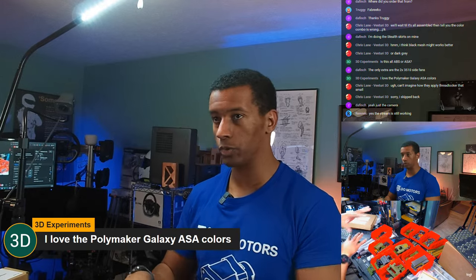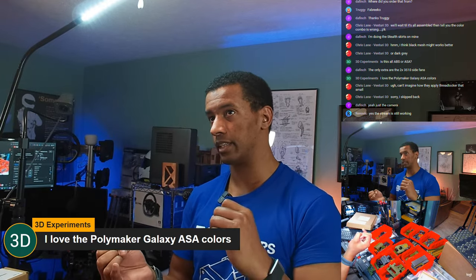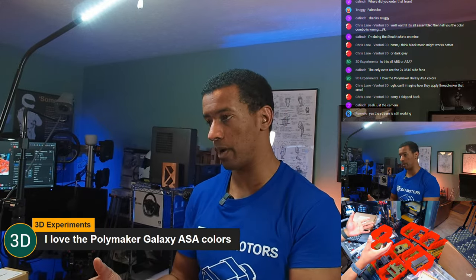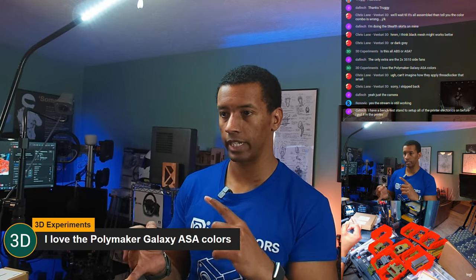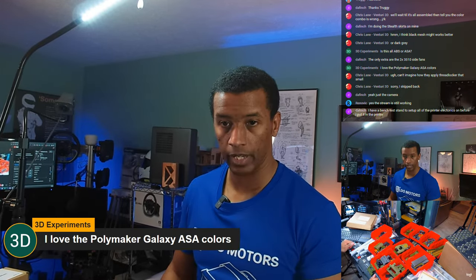So what I was thinking was showing people that you can basically bench build your electronics before you do the rest of the printer to, A, make sure that your fans are all working, to make sure that your boards are all working, get the Raspberry Pi flashed so that you can walk it over to your router, plug it in, SSH to it, and set up Wi-Fi that way. You can get your MCUs flashed while they're not on the printer. I was going to maybe make a video about that because it feels like sometimes 3 out of 10 people who have problems with their Voron builds or their V0 builds are having problems with flashing Klipper to the boards or getting their Pi to show up on Wi-Fi. So yeah, that was my thought.